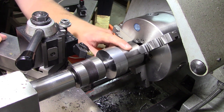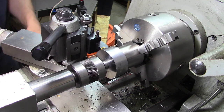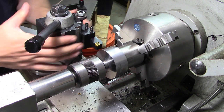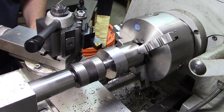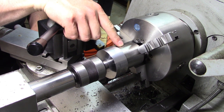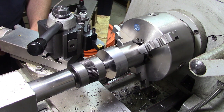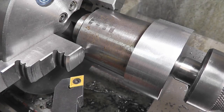I need to see what I can find for tooling to cut in here — I don't have a whole lot of left-hand cutting bits. I didn't have a whole lot for left-hand turning tool holders, but I do have this one from a set my buddy Cal gave me. Because of the proximity to the chuck jaws it's not going to be super ideal, but it's the best I'm going to get. I'm going to do it in two stages: carve away over here until I get down to the right diameter, then bring it up to the shoulder and blend it together. The center portion is going to get grooved anyway, so if there's a blend line it doesn't matter. I'll just make do with this.